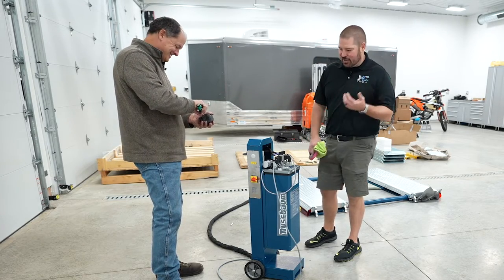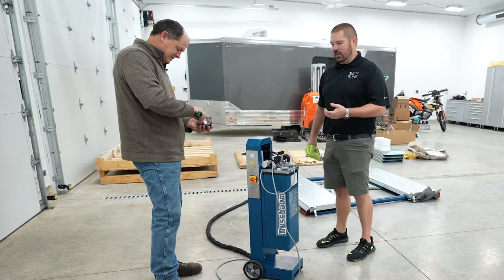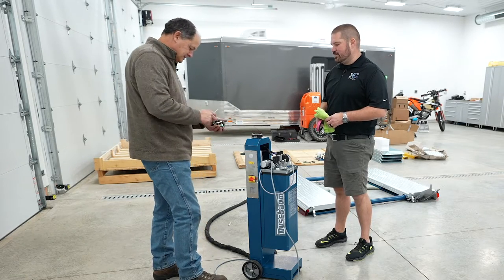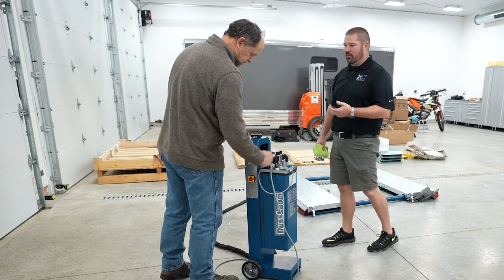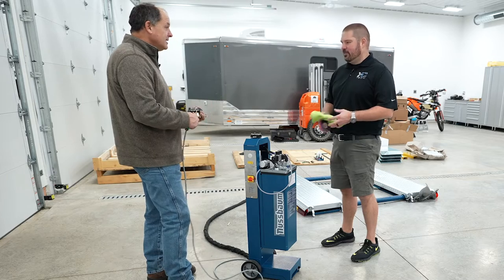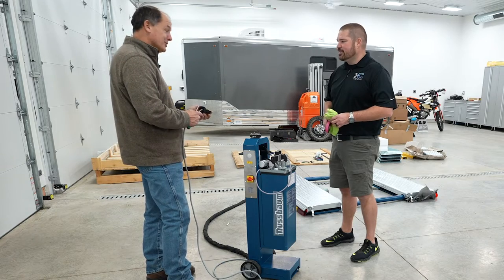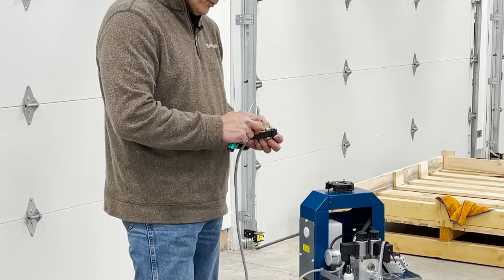Yeah, so as an electrician, I'm using a NEMA 14-50, which is made for electric vehicles and welders and all kinds of stuff. But everybody says, oh, I've got a 240 plug. And it's like, wait, is that a 50 amp? Is that a 30 amp? Is that a 3-pole, 4-pole, 2-pole? You'd have to ship them a whole box of potential plugs. That's why we don't put plugs on them. Makes sense. And a lot of people don't understand that.